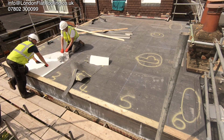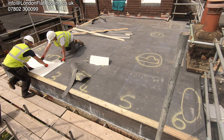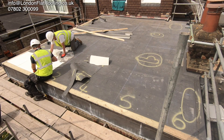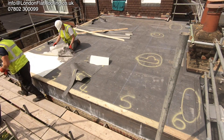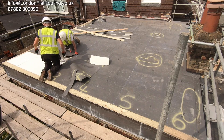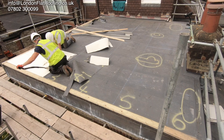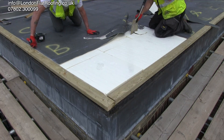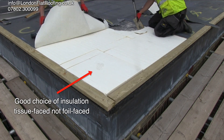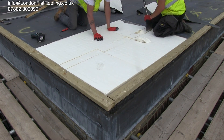Just look here — this is exactly where the two circles are. Once the two circles have gone we won't have a reference to see exactly where it is wet underneath, but it is actually on a line of where the insulation is joined. The insulation slabs are 1.6 meters by 600 millimeters by about 120 millimeters deep on this particular job. As Bob starts to lift this particular piece up we get to see — right underneath where the two circles are — if there is water underneath this particular part.